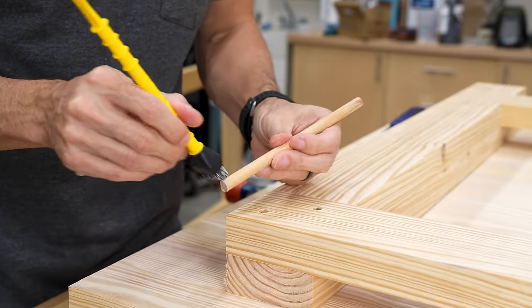Since I have this nice huge top, I'm going to use it to assemble the base. I'll put the top piece in place to act as a spacer to make sure that everything is nice and square before I move on and attach the shelf stretchers. Quick public service announcement: if you have two different screw lengths out and you're not going to use the longer one, just put it away — because if you don't, you may end up going through your work piece and screwing your clamps to the workbench. I now have some nice little holes in the front — I'm not even going to fill them. We always need a reminder that mistakes were made, we're not perfect, and we move on.